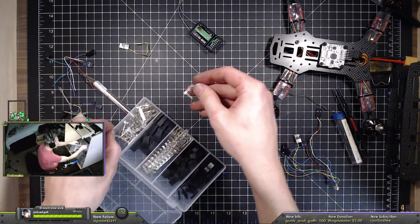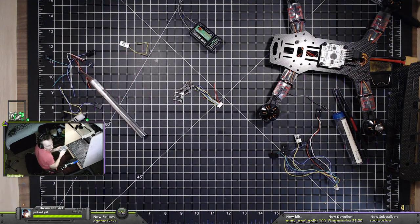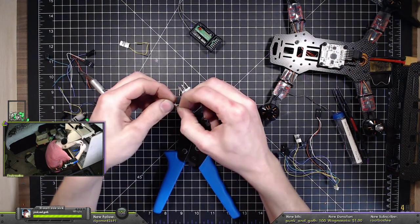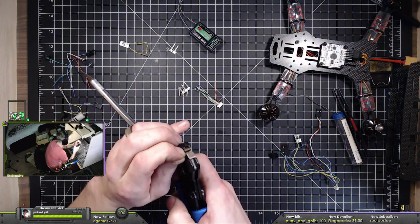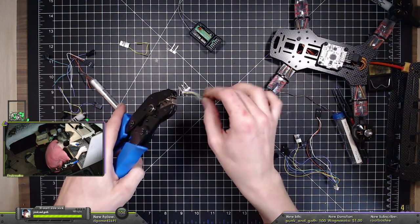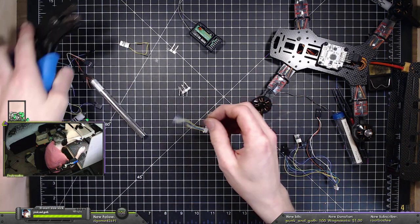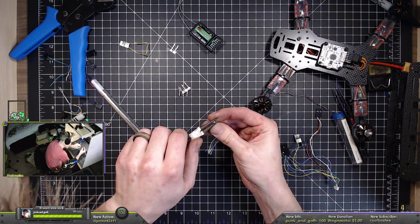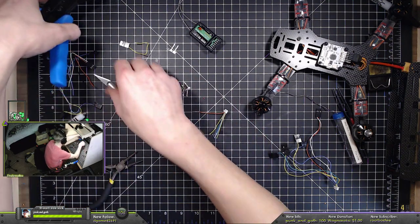So what we're doing is we're taking these and we're re-crimping them onto this and then installing the little black caps back on to make our own custom shortened DuPont harness. So, take the DuPont crimpers, break off the connector, install it in the crimper, get it squared up, insert the wire till you can see it just barely stick out the other end, crimp it, and then we need to take some pliers to square round the bottom off, because my crimpers are a little on the cheap side, so they end up squishing it a little too much.